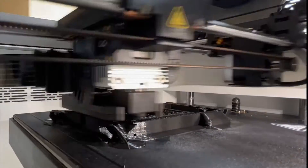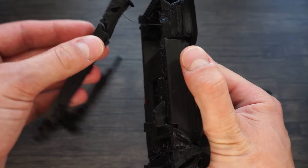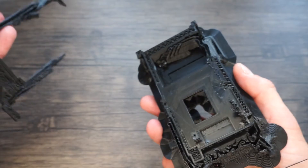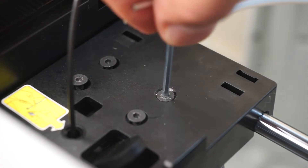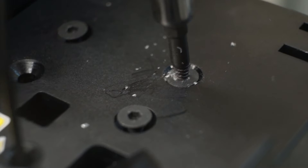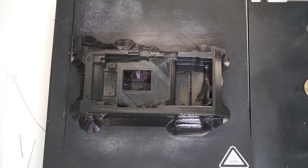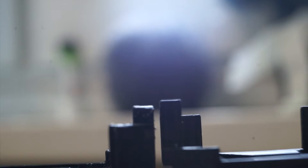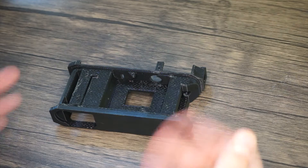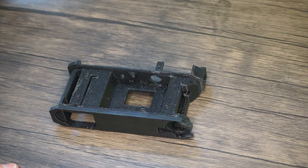Now came the time to print out the new version and find out how well everything lined up with the new calipers — which is where the fun really started. My first print was split in half; it seems to have clogged while ironing the layer, so I thought nothing of it and printed again, which went worse and nothing came out. I swapped out the nozzle and then found I had to take the printer apart to clear out the stuck filament. One screw came out nicely, the second one too. The third had some trouble, and the fourth did something very creative entirely. I tried epoxy which did nothing, so I ended up trying my luck with screw extractors, which worked a lot better than I expected. Finally I assembled and recalibrated the printer and sent a new chassis to it — only to find out the next morning I'd accidentally scaled the whole print down by one percent on all axes rather than just the Z-axis. Finally I've gotten it right: the correct size, the correct length, and it actually exists, unlike some previous ones.